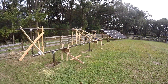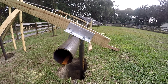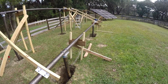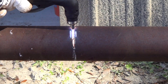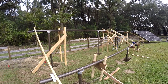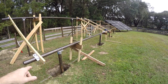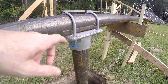Here's a quick review of what's happened to get us to this point. I started by picking up some schedule 40 structural steel pipe — three inch inside diameter, three-and-a-half inch outside — in 21-foot sticks, and I got seven of them. I brought them home and cut them with the plasma torch: four rails from four sticks, and the verticals by cutting one stick in half, giving ten-and-a-half feet each. All four of those pieces came from one stick.